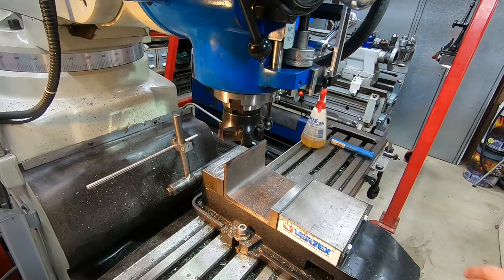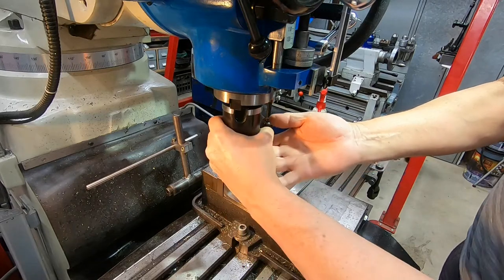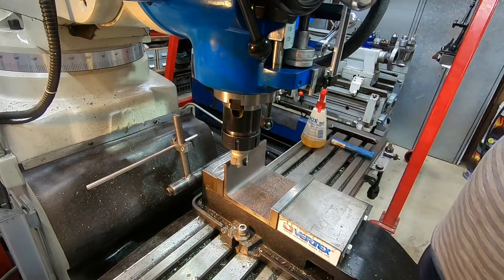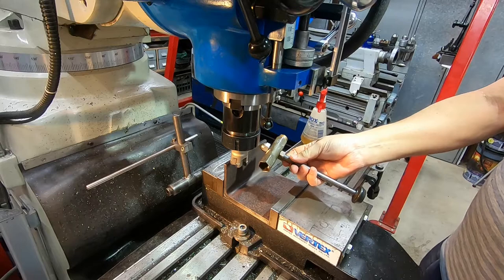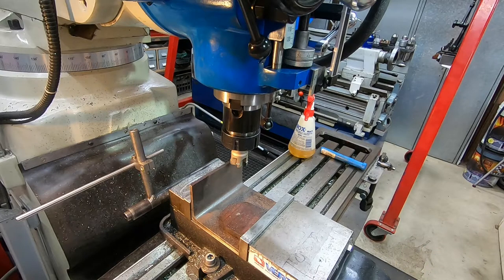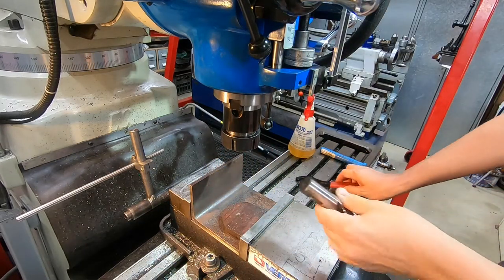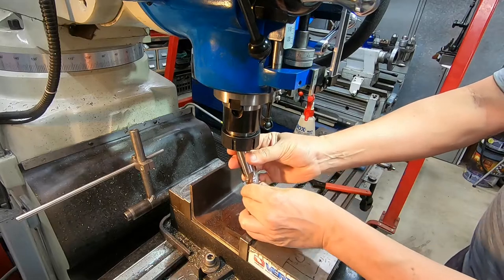Okay, well, time to switch the cutters over again. Put the one inch collet back in, and tighten them up with my Frankenhammer, combined hammer and socket. Get my piece of wood under the cutter in case it falls out. They do seem to like to do that when they come loose. There we go. I think we might start with this roughing cutter, roughing end mill.